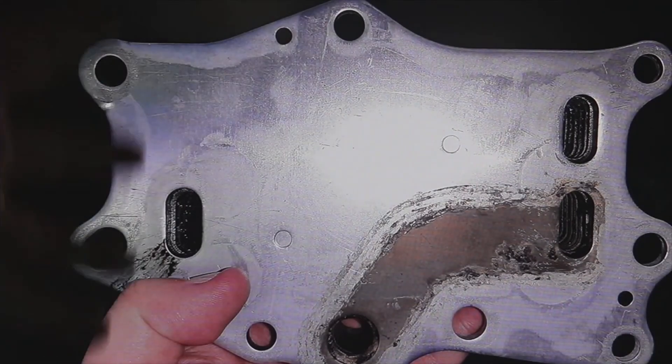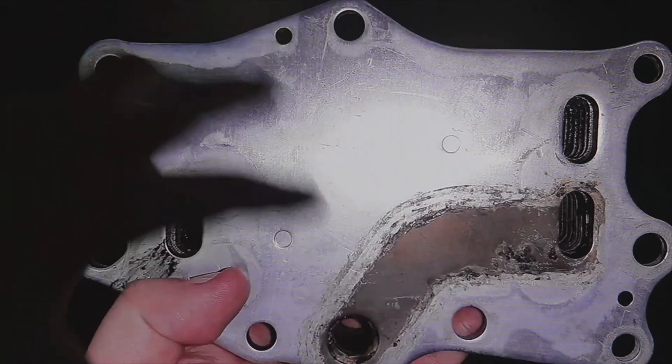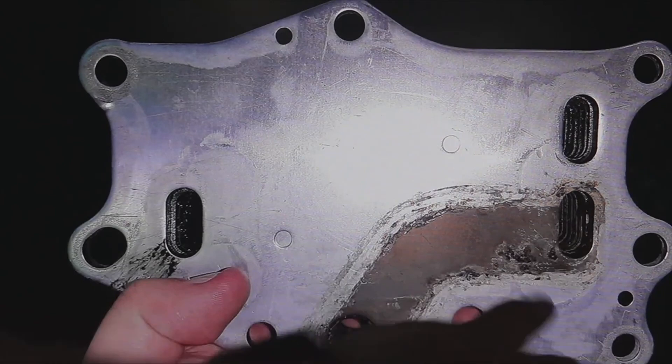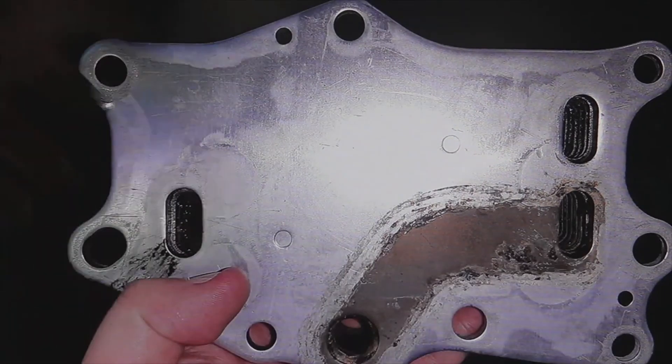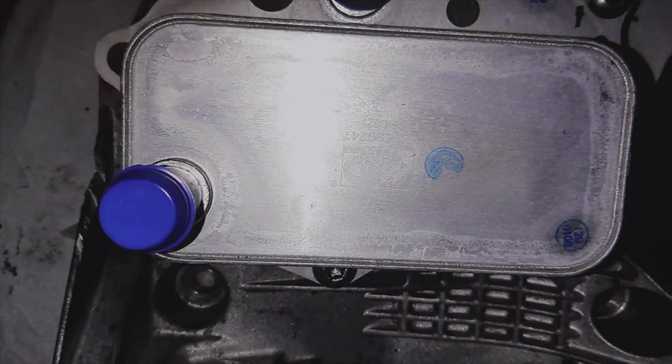This is the new one, and it is good. The entire oil system has been cleaned, it has been installed, and the vehicle already works without any problem. You can do the test by blowing hard — if you see that air comes out from the oil inlet or outlet side, you know the part is bad. But sometimes, if the crack is very small, you have to use pressurized water or pressurized air, plugging the other outlet, to see if it communicates inside.